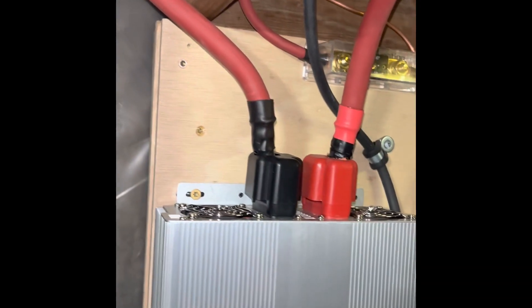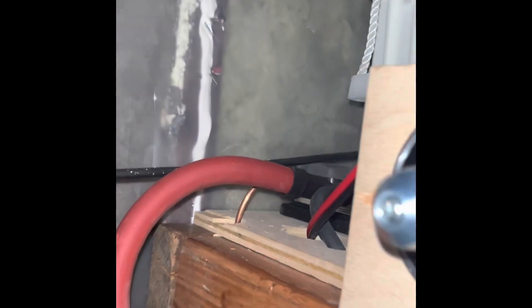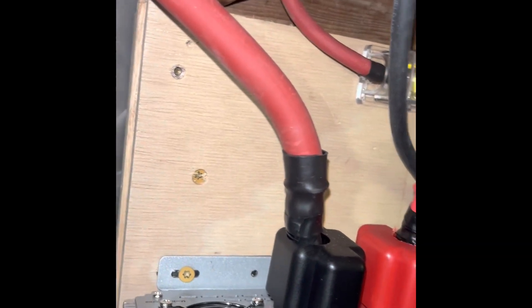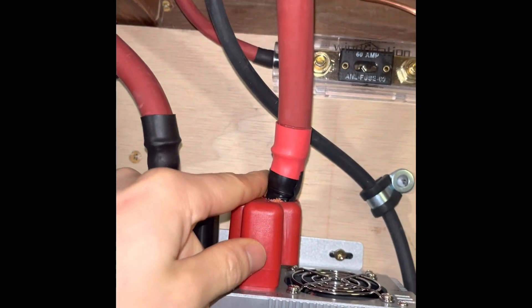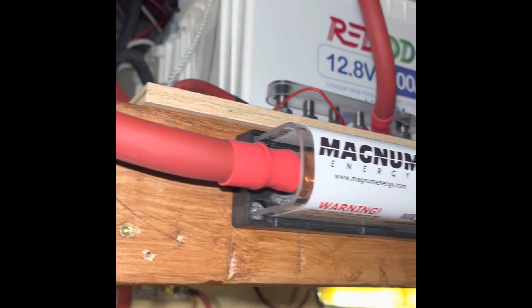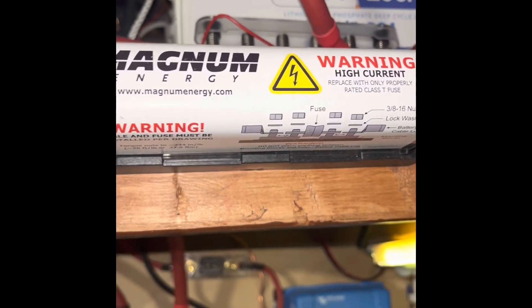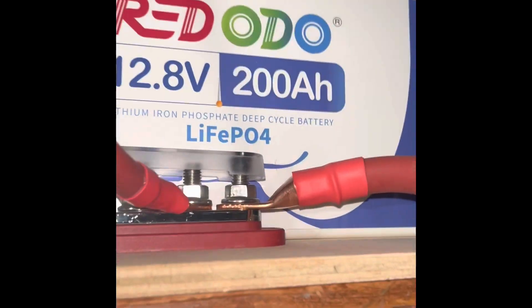This is the ground for the negative bus bar right there. We have 4 aught cables from the inverter to the batteries. That's the negative — even though it's red I have black heat shrink on there — and that's the positive coming up here, going to a 300 amp T fuse. These are quick-blow fuses which are recommended for inverters, going up to the bus bar.